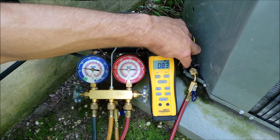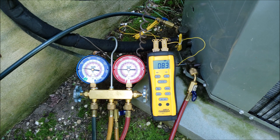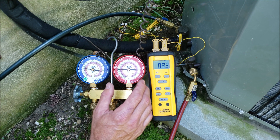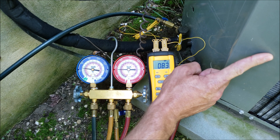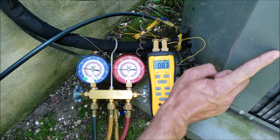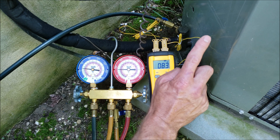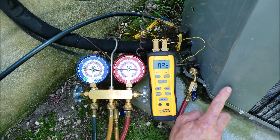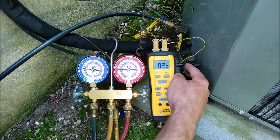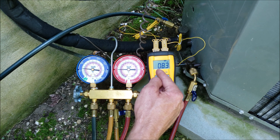So this is the temperature on the outer line — it's the small liquid line. Subcooling is the temperature decrease in liquid form of the refrigerant. In this outdoor condenser coil, you have a saturated temperature of 92 degrees. Right when it turns into a liquid, it's still 92 degrees. And then as it moves through this outdoor condenser coil, it's rejecting heat, and it comes out through this line and through the service valve as a high pressure, high temperature liquid refrigerant at 83 degrees. So it lowers in temperature.